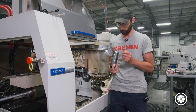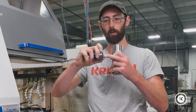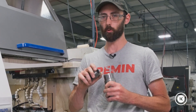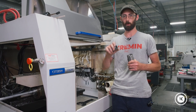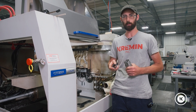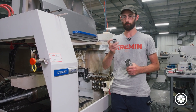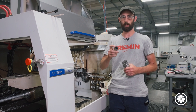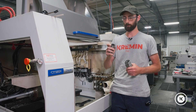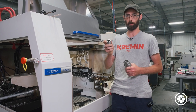Grab the spring off the floor. Drop it in there. This is turned up about ten thousandths over the OD of our tube. You do not want a slip fit — you want a loose fit because this is going to be turning and that tube is going to be static, so it's going to rub a little bit. It's fine. This is just some sort of plastic — Delrin, nylon, PEEK, PTFE — doesn't matter. You just don't want it to be tight. It'll self-clearance a little bit, but you don't want to melt it or start a fire.